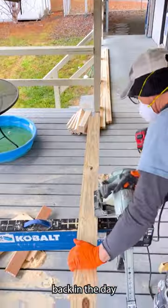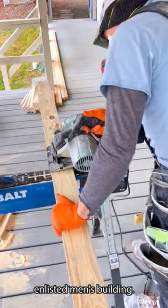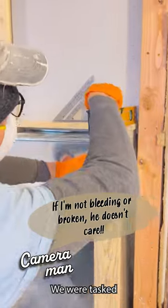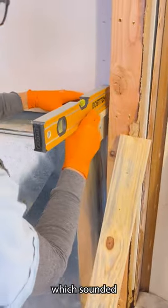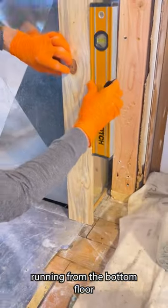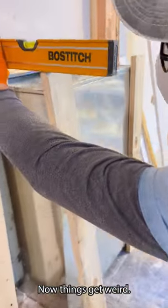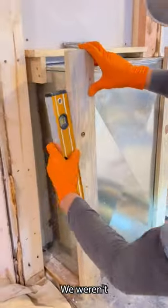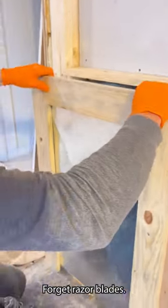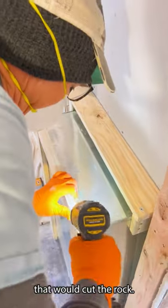This job reminds me of back in the day when I landed a gig on a Florida Navy base working on the enlisted men's building. We were tasked with updating the heating and cooling system, which sounded straightforward enough, but here's the kicker — they needed to chase a whole vertical tunnel running from the bottom floor all the way to the top. Three stories tall. The framing for this chase was crazy. We weren't dealing with the usual half inch drywall. This beast needed one inch thick slabs. Forget razor blades — those things wouldn't even scratch it. We had to break out the jigsaws. It was the only thing that would cut the rock.